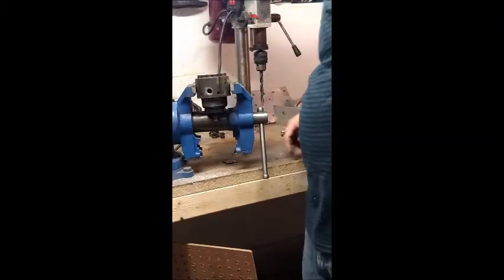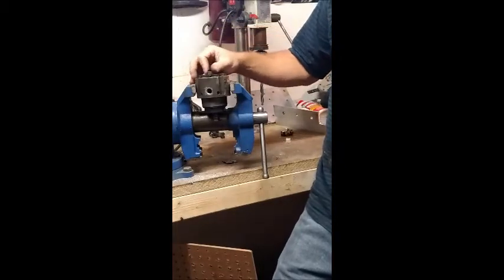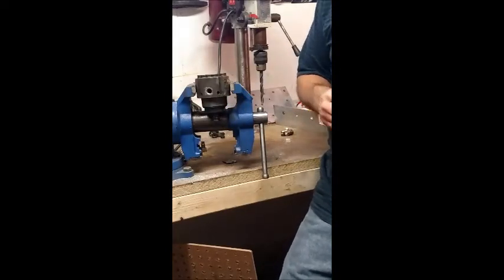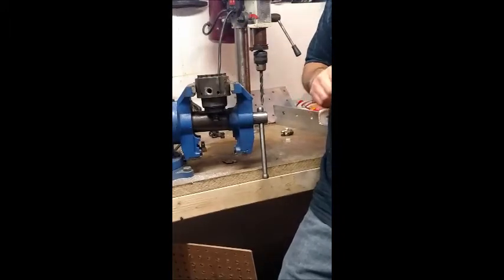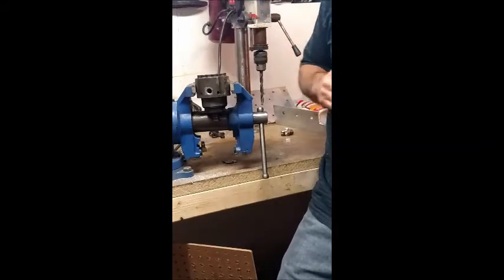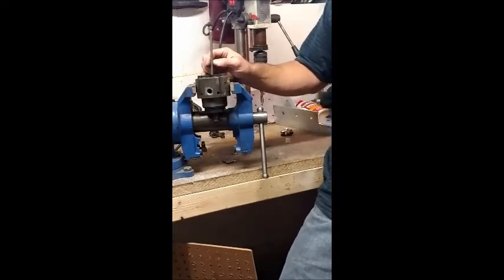The first thing you're going to want to do is find this plug right here - it's a three-quarter inch bolt head. That's your center plug in the hydraulic head. Go ahead and pull that plug out. It's also a wise idea to unplug the in-tank fuel pump at the fuel tank, because as soon as you turn your key on otherwise fuel will start to spray or geyser out. Then you're going to take a wooden dowel or a brass drift - not a machined tool - drop it down in the center hole, and have somebody turn the truck over while somebody else watches.